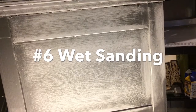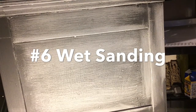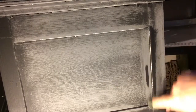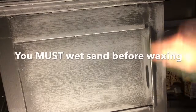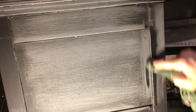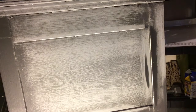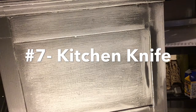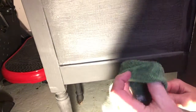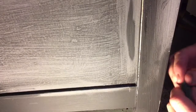Wet sanding is pretty much like it sounds — you take a wet cloth to your dried paint and rub until some comes off. When you wet sand you can get down to whatever color is underneath the top color, but you won't be able to distress down to bare wood. So if you just want to see the color underneath, wet sanding works. You can also use things not intended for painting, like a kitchen knife — wrap a wet rag around it and carefully go along the edge, but be really careful because it's easy to get off track and scrape something you don't want to.